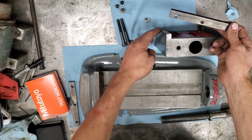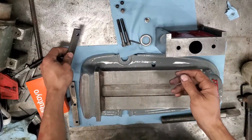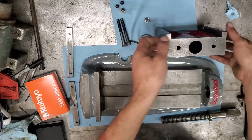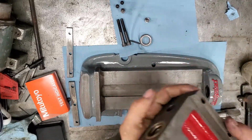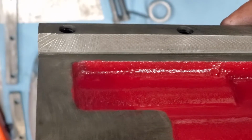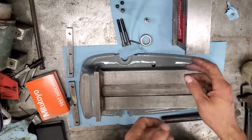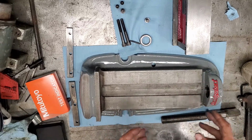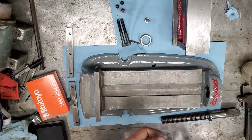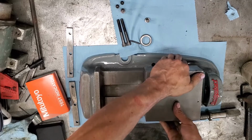So we're going to check this setup for wear, and it's really easy to adjust these. All you have to do is make this a little shorter. You can file it, sand it, check it with a Dykem, and then pull that cap in, and that makes that tighter. Where you have a harder time is on the inside here, because once this material wears out, how do you get it to grow back in? And you'll notice, or I noticed on this, we'll zoom in a little bit here. You can see those checker marks there, those hash marks? So that's knurling. And they do that to raise the surface. I don't know if that happened when they made it as part of the factory design process, or if this has been torn apart and someone's worked on restoring it before and they wanted to make that a little tighter in there. So we're gonna check it with an indicator and see just how worn out we are side to side.